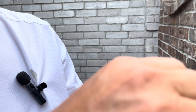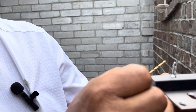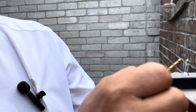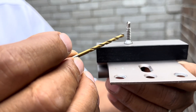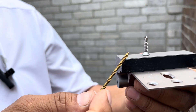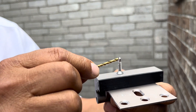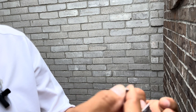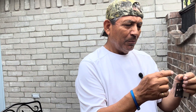You can also use these self-drilling screws — this screw is made for metal. If you look here, there's a little arrow tip that makes the hole in the metal as the screw goes in. This works in case you don't have a metal bit, but if you have the bit, you may not need these screws. Also, this screw only works on thin metal — not too thick — because the tip will wear out quickly.